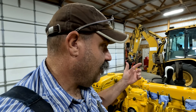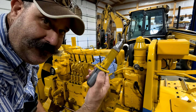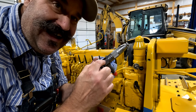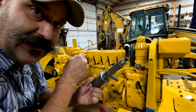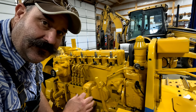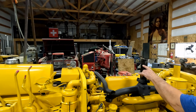This is the one marked number four on their list — we're going to put it in number one cylinder. It's the best injector of the group. Test number five goes in cylinder two, test number three in cylinder three, and test number six in cylinder four. Let me snug them down. Then we're going to start it up — you want to do the honors? Put the stack on. This is our special wet stacking break-in stack.